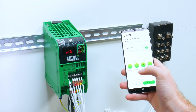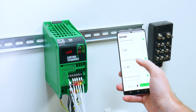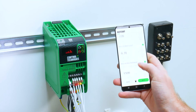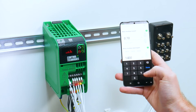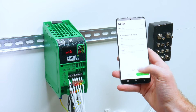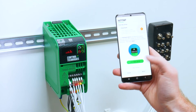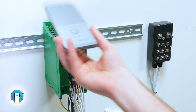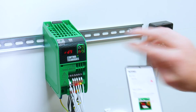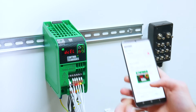This will take you through four key steps to get up and running. The first step is motor. My motor rated voltage is correct at the default value of 230 volts, so I set my motor rated current, my motor rated speed, and my motor power factor. I then perform a spin test by downloading a preset configuration to the drive for the test and then holding the up and down keys to run the motor at a jog speed. I check that the motor runs in the correct direction, and then complete the spin test.